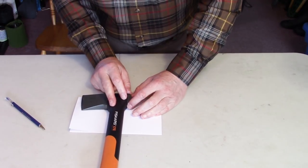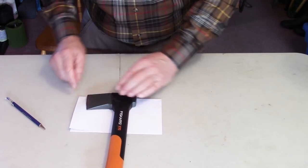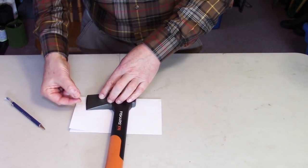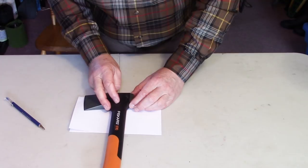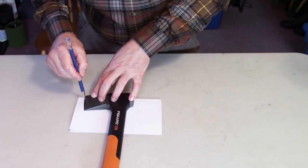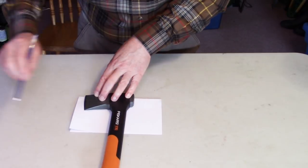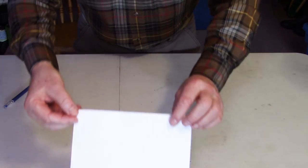The easiest thing to do is take your hatchet — or axe, whatever you're going to use — lay it on the paper and bring it up to the fold line. Rather than going all the way out to the edge of the material, come back about an inch from the material. The reason for that is we're going to be putting pop rivets in the material here, and you need a little bit of room for the pop rivets to catch on and create the pinch that'll hold it. So about an inch — it may be a little bit much for this little hatchet; I might close it up to about three quarters of an inch. I'm right along the top line of the fold. I'm going to quickly draw around with pen around the hatchet, just to give me a reference for the next step.